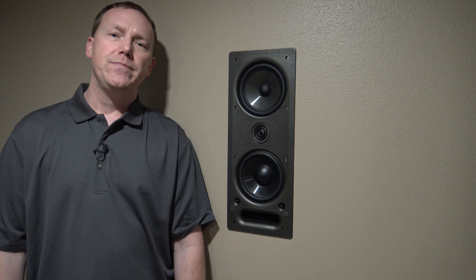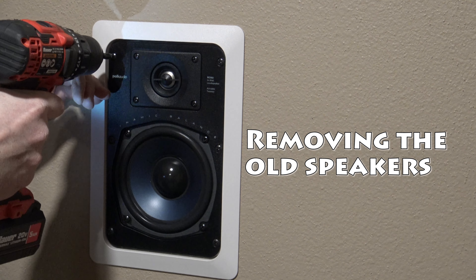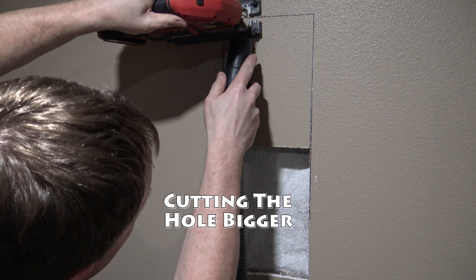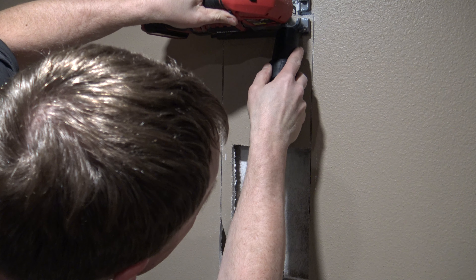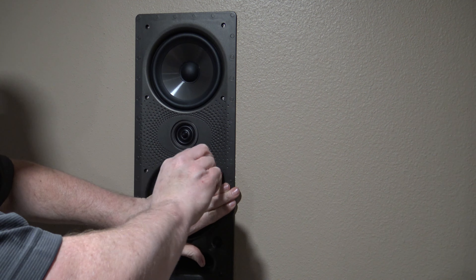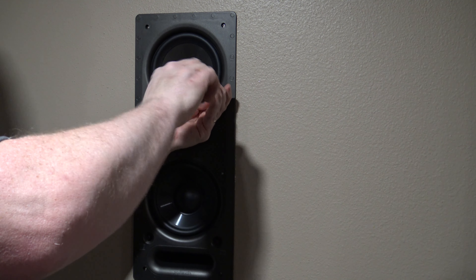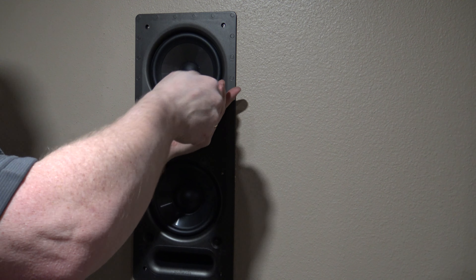Before I play any music or a movie, I want to show you a little bit of the install process so if you buy these speakers you know what you're getting into. Go ahead and connect your speaker wire and push the speaker into the wall. You will have to turn the mounting screw a lot — it has about an inch to go before it tightens up against half-inch drywall. Once you start turning and think it's going forever, don't worry, it will tighten up. You'll feel it get snug, and then you only want to go about a quarter turn past snug.